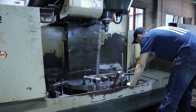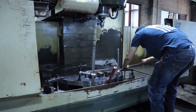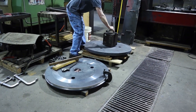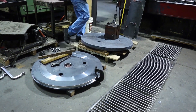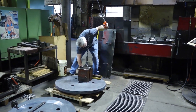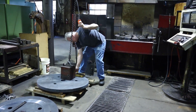This is Trenton. He's one of our interns. He is in the second stage — we're not completely in order. He is fastening the plate to the machine to do some drilling and tapping. This is Cliff. This is the first stage of gear production. These blanks come in just like that; he's going to load it into the machine, turn it, face it, do some bore work, and then it'll go on to Trenton, and in just a minute we'll see where it goes on the gear hobber.